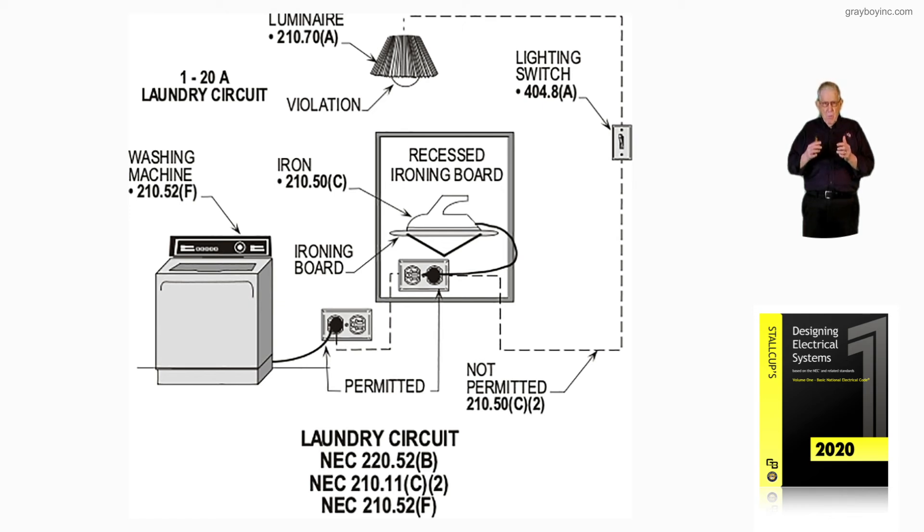We will be putting more of these requirements together as we go along. As an electrician, designer, or inspector, you can review Chapter 14 and pick up the procedure to calculate the loads in VA or amps for any particular piece of equipment installed in a dwelling unit, as well as taking square footage and figuring what the VA would be. We'll be doing this kind of thing as we move on through these illustrations. So now let's move to the next illustration.